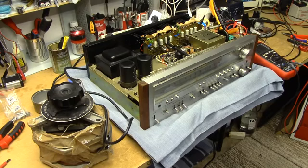Anyway, we are about to find out, because I'm going to put these in a bag, and we're ready to use my Variac of Death to give this thing a bit of a go. Now, normally for testing an amp like this I'd use my TTI power supply, but this thing has so many power rails that I simply don't have enough channels to do that. I need to have the transformer of the amplifier hooked in anyway, and in order to disconnect power to the amplifier board I would have to desolder some wires, so I'd just rather use my Variac since I have one anyway. I have not connected the power transistors since, although they test fine, I'd rather find out whether or not the preamplifier board or the driver circuit works fine before hooking those back up, just in case.